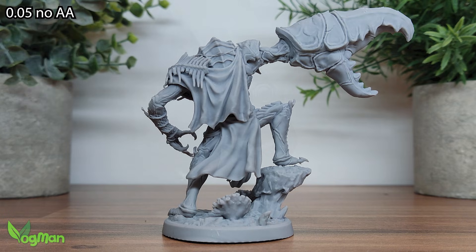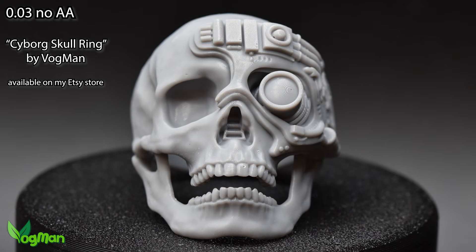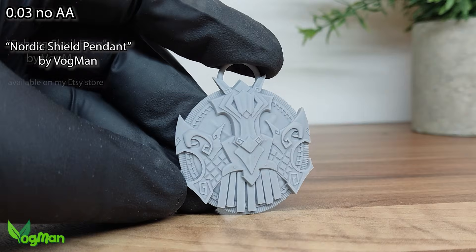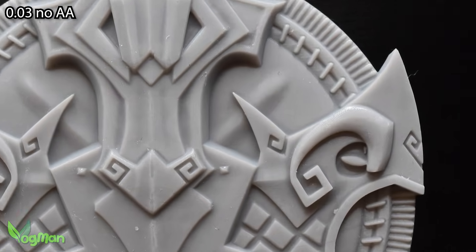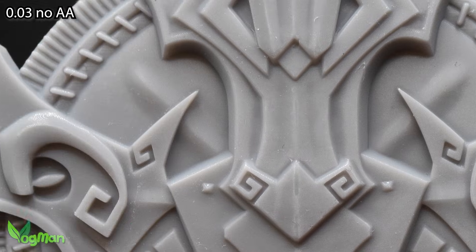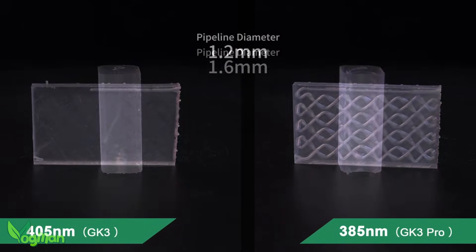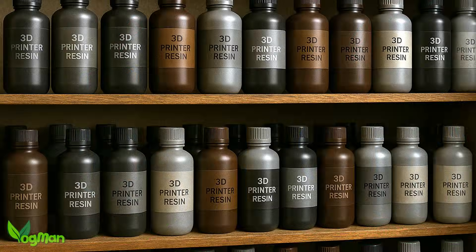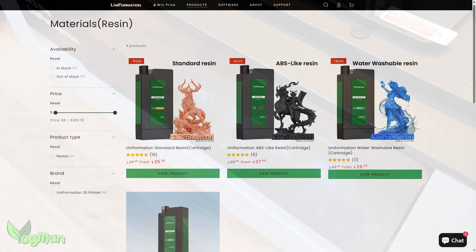The app remains a mystery to me, but a little internet digging suggests it is live, though still very new, so hopefully that's something we'll see stabilise soon. The 385nm resin benefits are difficult to prove without two identical printers supporting different light sources, and the fact that I haven't had access to 385nm-specific resin just makes this worse. I'm a little concerned this may restrict folks from using any resin other than Uniformation's, which I don't think is a very smart marketing move as monopolies tend to be unpopular. Furthermore, I would imagine that not all 405nm resins will produce ideal results, so do shop for your resin with all due care.